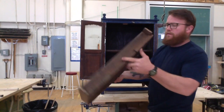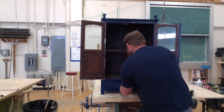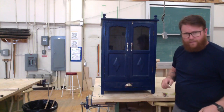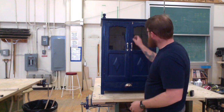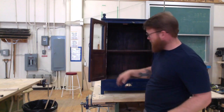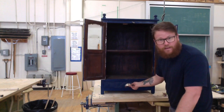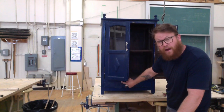All the stuff has been reinstalled on the cabinet — doors are in, it works, drawer works as well. I'm going to focus for the next 20 or 30 minutes on touch-ups, meaning where I nicked paint when I was refinishing. I'm also noticing that this drawer is a little uneven, so I'm going to tack some boards in behind it so it closes nice and flush.